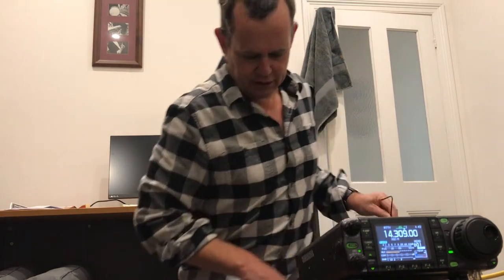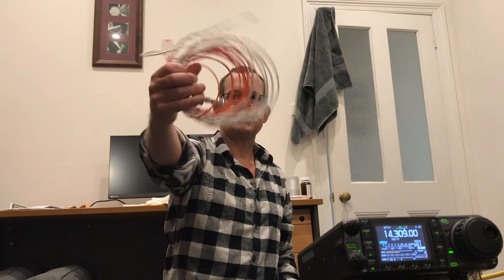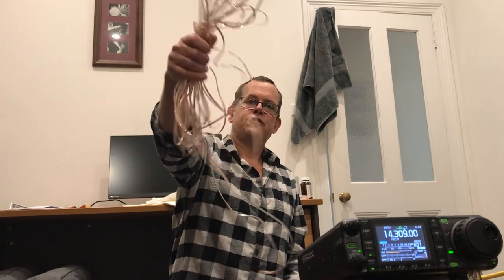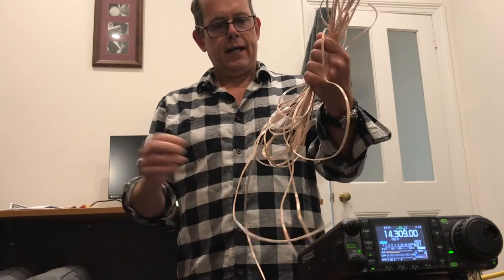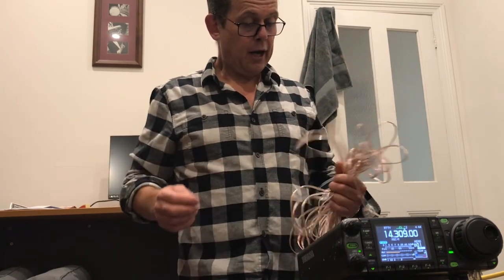Here in Australia a lot of the VKs work on 40 meters. I've got my resonant 20-meter boomerang antenna, which I'll use for 20, 17, 15, 12, and 10 — maybe with the tuner. I've also got 35 to 36 feet of speaker wire which I just bought, so I'll split it and do a boomerang for 40 meters, cut it roughly to size and use the tuner, or if I have time and can get it high enough I'll try to make it resonant for 40. Hope to see you on the air tomorrow — cheers and beers for VA7BIX!